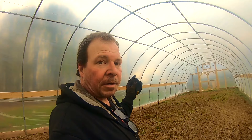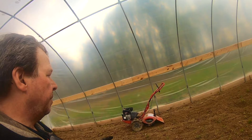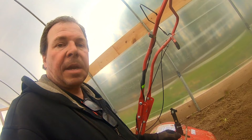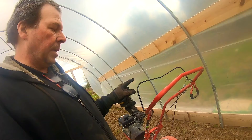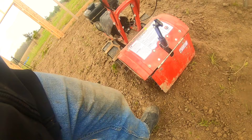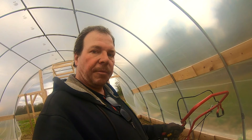After I stopped worrying about making the video and could concentrate, I got this initial pass done in about 15 to 20 minutes. This is what it looks like after just the initial pass — not bad. I did that on the second drag stake adjustment. I'm going to keep moving the stake up so we can get deeper on each pass. Hopefully I only have to do one or two more. When you go in reverse, let go of the lever to stop the tines from spinning, then pull the reverse lever. One tip: lift the tine shield up before reversing so it doesn't get hung up.